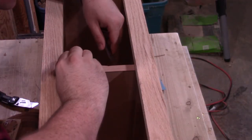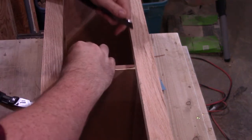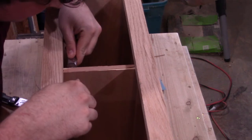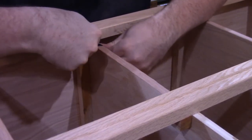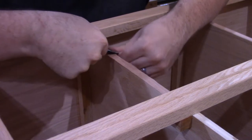With that done, it's time for edge banding. Usually I like using solid wood edge banding more as opposed to iron-on — more because I really hadn't used it before. Now that I've used iron-on edge banding a bit more, I still like solid wood edge banding more. For the red oak edge banding, I found it was a bit of a pain to keep it from tearing out. I think I replaced some pieces three or four times before getting it working. What I finally found to work best was a strip of sandpaper, sanding through the corner of the edge banding until it was weak enough to just pull off without tearing the rest of the piece.